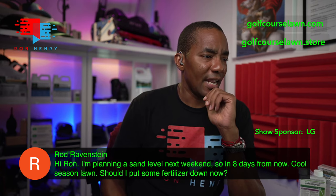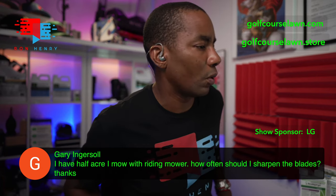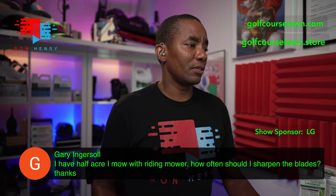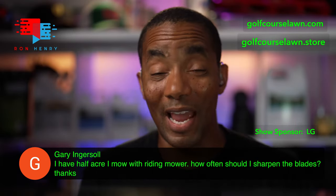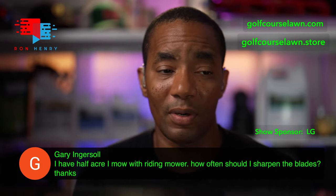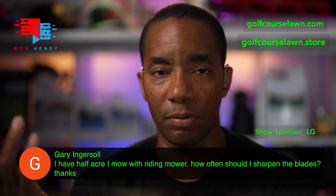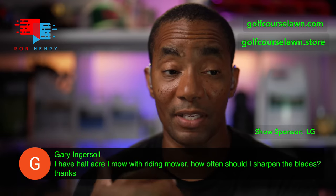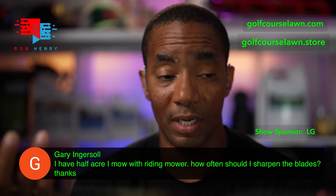All right, Gary Ingersoll says, I have half an acre that I mow with a riding mower. How often should I sharpen the blades? Thanks. Depends on how often you're mowing, Gary. If you can, monthly. I know it's a lot of work. Some people will say the entire season. The guys that mow lawns professionally, some of those guys will sharpen the blades every couple of days. Some guys will do it every day.